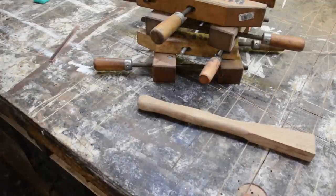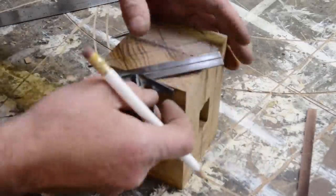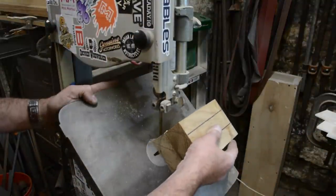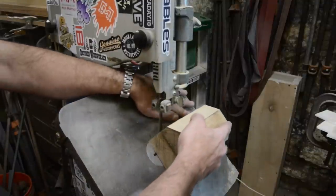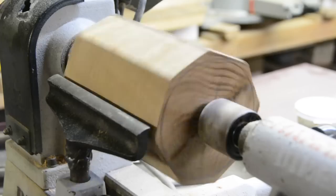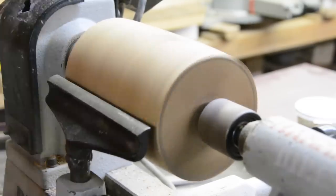It fits really good. Now it's time to find the center of the mallet head, which isn't hard. I'm going to jam off the corners because I don't really like turning a square - it's possible but it's a lot of extra work when I can just cut that off on the bandsaw. I give myself the guides and set the bandsaw to 45 degrees to rough off the corners, which makes the lathe work a lot easier and a lot quieter. Lathe-working a full square is really noisy.